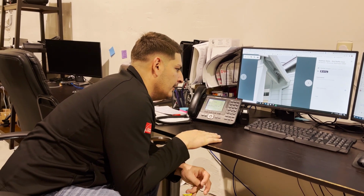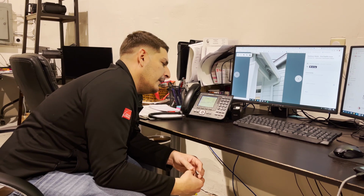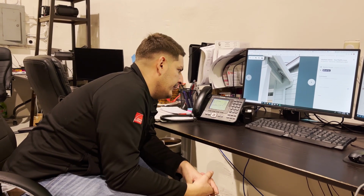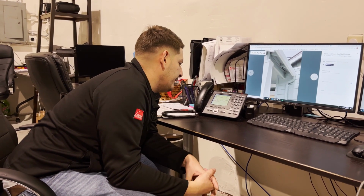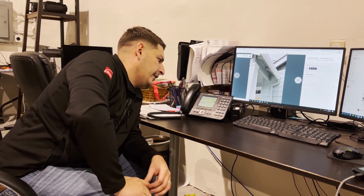Okay, it creates a vacuum. Yeah. And when the air's coming inside of it, guess what else is coming inside? Snow. But obviously the snow did the trick. But yeah, it's unfortunate that these guys are even using them. They're exhaust vents. They're not made for intake. They make special vents for intake. Gotcha.